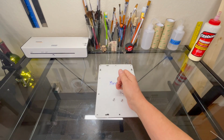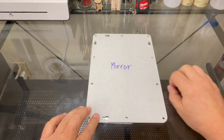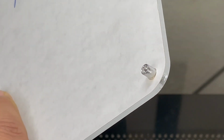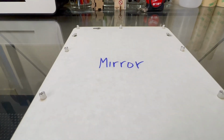I'll remove it later. Here's a close-up of the M3 rivet nuts. A 35mm hex bolt will be screwed into these rivet nuts to hold the piece together. So let's insert these rivets into the holes and put it aside for later. All parts for this project will be listed in the description below.